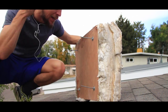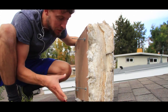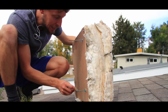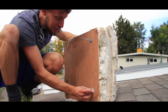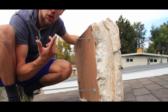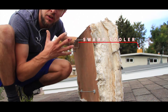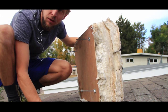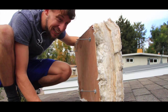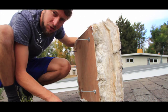Two years ago I decided to make this contraption. It looks a little rough, but it works. Basically it's two pieces of plywood with insulation in between, held together with these homemade clamps that I made. What I was realizing is that if you cover your swamp cooler with a tarp and some cellophane wrap, that's great, but the hot air from the heat you have on in the winter is still going to go up through your roof easily.